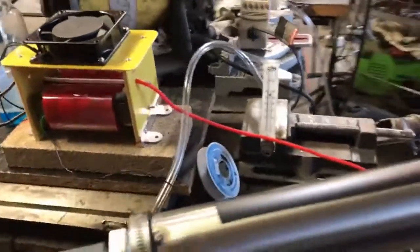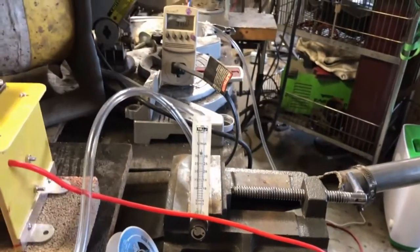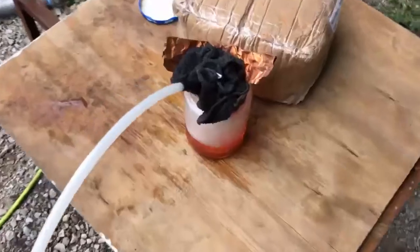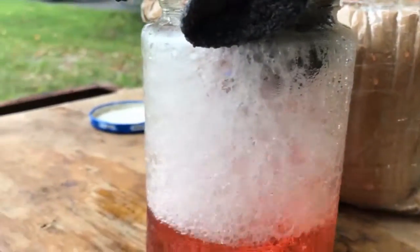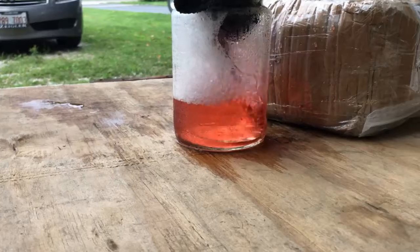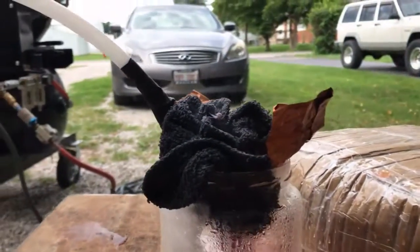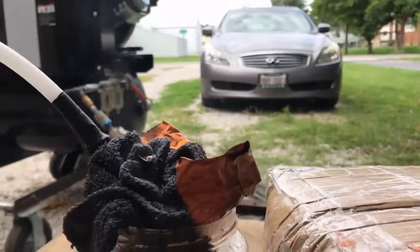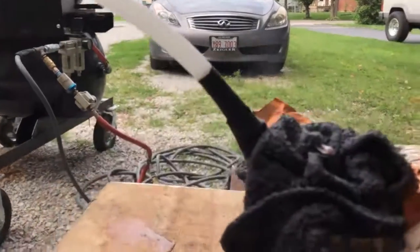If this was leaking, the air bubbles would be the size of quarters. You want to be over 30 liters per minute of input just to help cool this thing off. We're putting off copious amounts of ozone, and I've noticed that this foam-up you see is indicative of ozone production — it seems to be doing something to the dye itself, causing it to froth. We're already getting some color change. It's very endothermic in nature; this jar is getting cold, and look at this vapor coming off of here. There's a mysterious vapor that I have not yet pinned down.